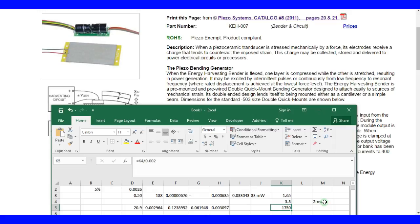But when you're talking about energy harvesting, piezoelectric materials aren't the only option. You also have solar, which is much better. You have electromagnetic energy harvesting, which people don't really know about that much, or don't consider as much. You can harvest electromagnetic energy from a magnetic metal, or a magnet, going through a coil. The magnet can be attached to something that's vibrating, and the coil can be stationary, and then you can generate current from that motion and store energy and voltage in the same way. But it can harvest a lot larger amounts of energy.